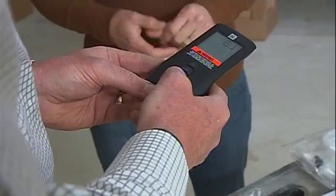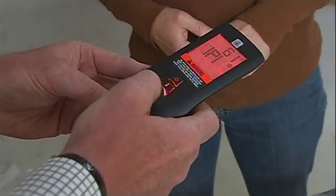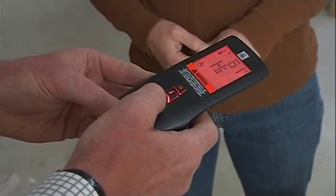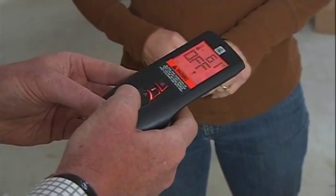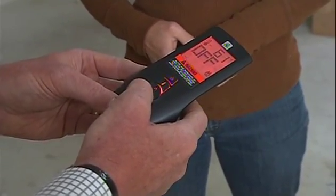This unit has a remote — that is correct. It has a multi-function remote control that allows you to operate the unit either as a standing pilot or continuous pilot operating system. Through the remote control you can control the flame height as well as the fan speed, a light function, and a split-flow burner feature where you can turn on and off the back burner.